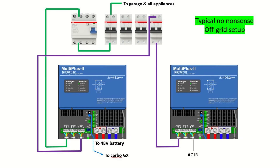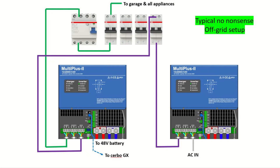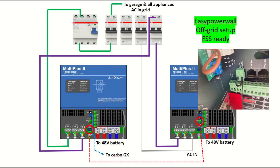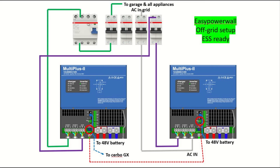This is a typical no-nonsense setup. I mentioned before that I have a non-typical grid setup with 3 phases without neutral. So if I want to configure the system for zero grid consumption I have to feed the power into one phase. To add extra power I will connect the AC out of MultiPlus 2 via a breaker to AC in of MultiPlus number 1 — this will generate extra power in one phase, so I have to upgrade cabling to 6 square millimeter or 10 AWG. To start the second MultiPlus you need a cable between the blue contact of MultiPlus 1 and the remote switch of MultiPlus 2. I'll show in a future video how to program this functionality. The AC in connected to the second MultiPlus also goes via a breaker — this is for extra safety and allows me to switch off everything in an emergency. I will add these images to the download folder; the link is available in the comment section.